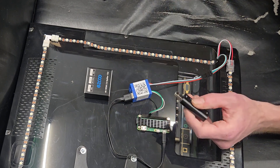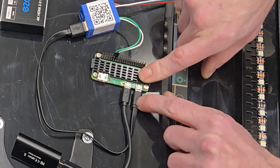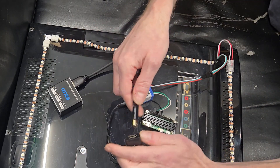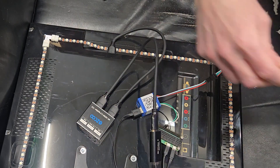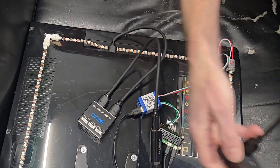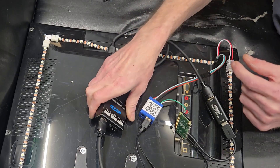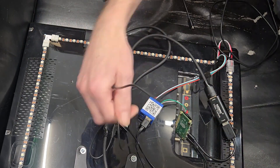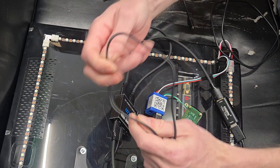We've got a capture device and an OTG cable — we'll go ahead and plug that into the other USB port. The bottom one, or the one closest to the edge, is your power, and the other is your actual USB port. HDMI out number two goes to our capture device; we need another to go to the television, so this goes to HDMI out number one. Normally your source device might be a streaming box; I've got a little Roku, so I'm using a short HDMI cable for my input. The splitter came with a Type-C to Type-A cable, and we're going to use that handy extra port on the level shifter to power it.